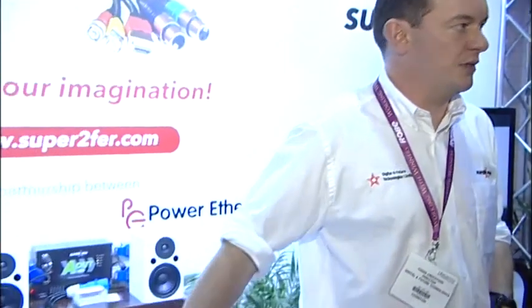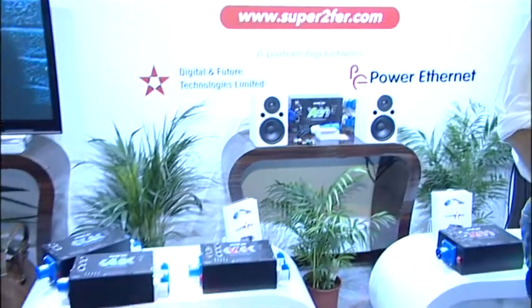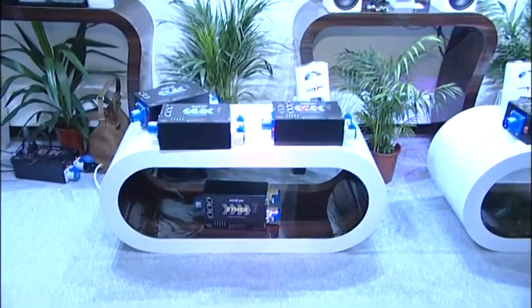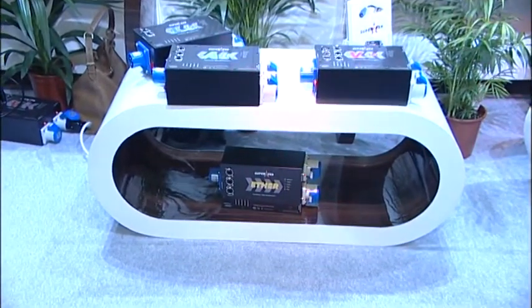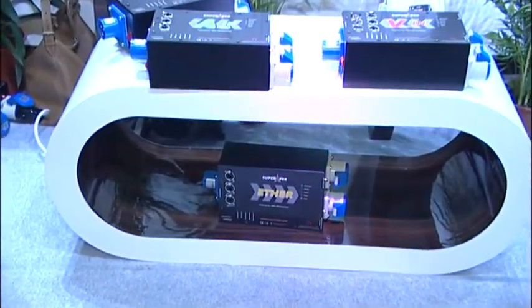And we also have an Ethernet box, which is the one you can see just down here, which is basically 3 standard Ethernet ports out. The idea for that is people who are running out 16 amp for festivals, etc., you can just leave one of those boxes in every porter cabin, and now you've got your entire network built. It's safer than wireless, it's encrypted, and you've run the cable anyway, so you may as well get the network that comes with it.